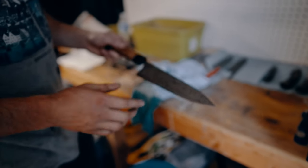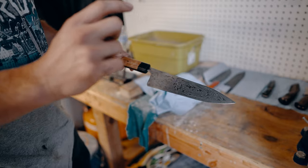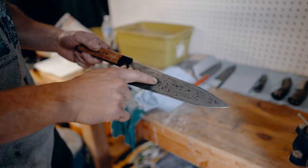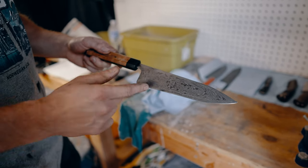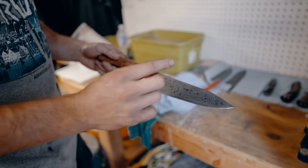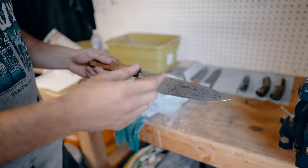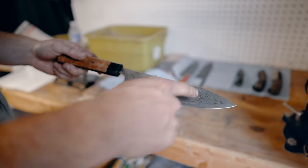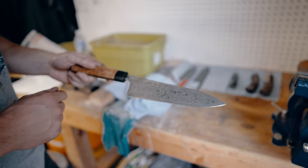This is one of the simpler patterns. What I do is alternating steels — I'll do a high carbon which comes out black, and then a high carbon steel with a lot of nickel in it and that'll come out brighter. I alternate those and fold them and forge weld them until I get the amount of layers that I want. Here I just cut grooves into it and then forged it flat and came out with a ladder pattern.